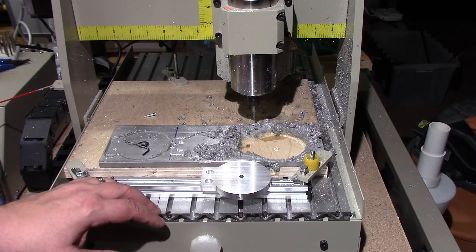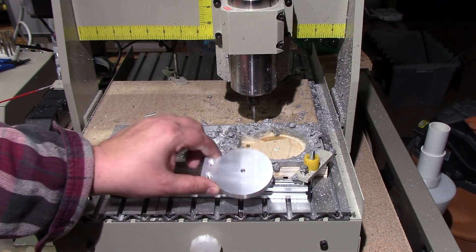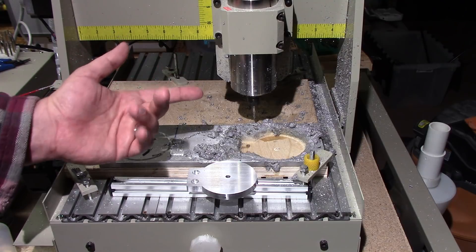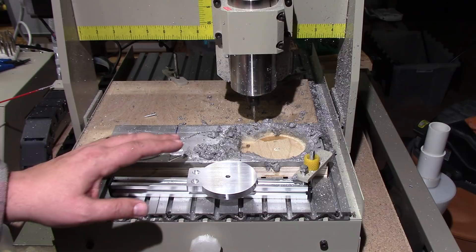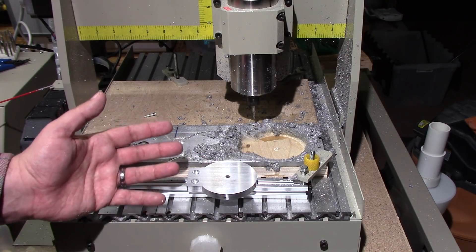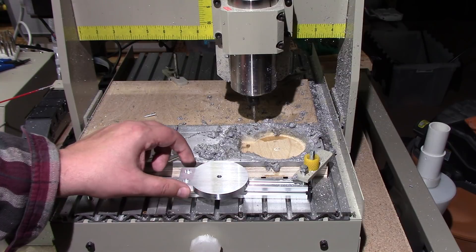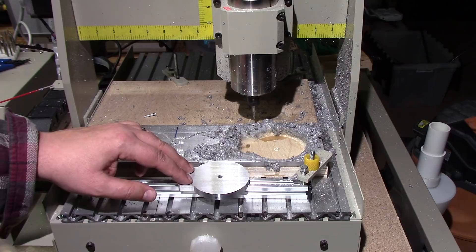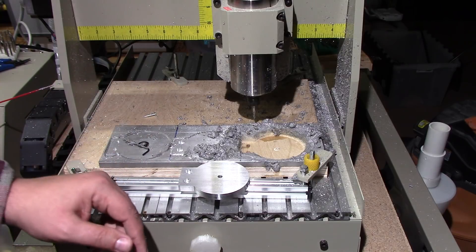One of the other things I want to mention as a tip: one of the reasons I like going down into the material is this material is not perfectly flat. I don't have a fly cutter — I don't even know if you can run a fly cutter on this. So I have to live with the surface finish of this machine, unless I maybe want to take like a 6mm end mill and kind of swath it over. Taking it down into the wood covers any sort of deviation in the surface height of this material. I don't go far — like a quarter millimeter into the wood — and it does a very nice job.